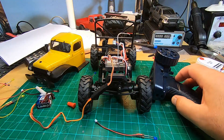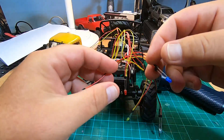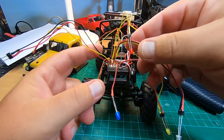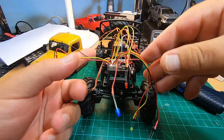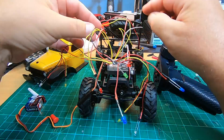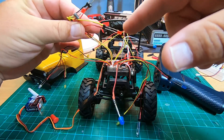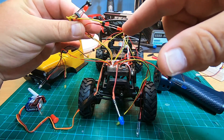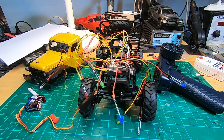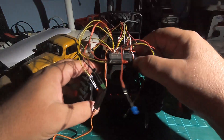Now I will connect all those LEDs to show the light controller. I connected the two fog lights - I use blue lights here, those are only one LED on a plug. Then we have the two main beams including turning lights left and right, and a further three pin plug for turning lights left and right. We have the awesome four pin plug with three LEDs: reverse light in green, then a brake and normal rear light. Let's switch off the room light and switch the unit on.